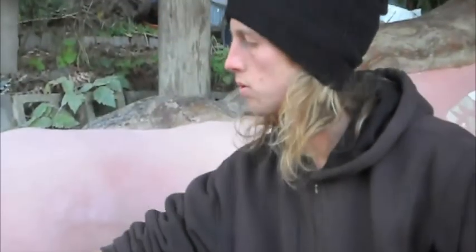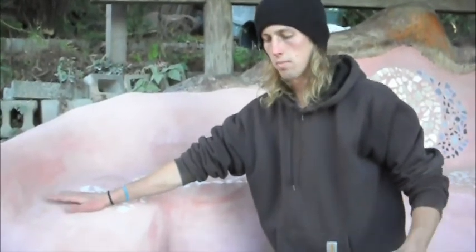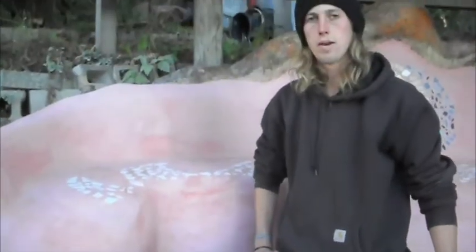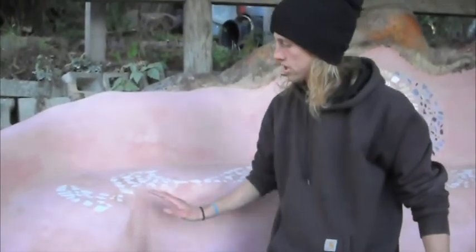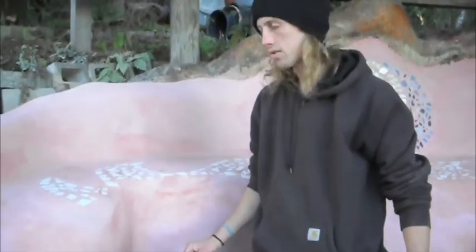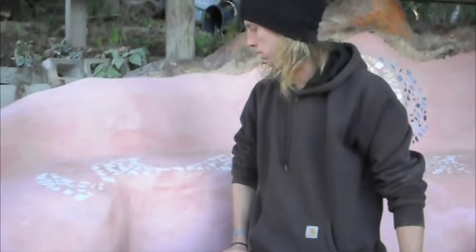Cover them with plaster, smooth it out, and then fill the area that's the worst with more plaster and smooth it all together, being sure to come back on a regular basis for the next couple days and check it for cracking, wipe it with a rag and smooth it in. Those are the two scenarios you should encounter in repairing and taking care of this bench. Anything greater than that will obviously require a more serious approach.